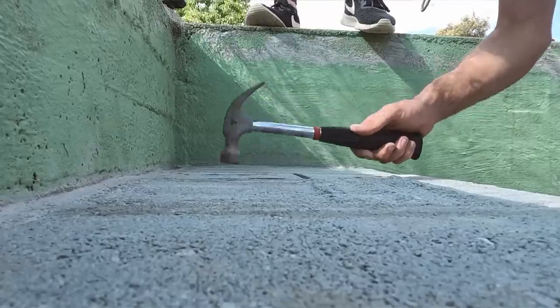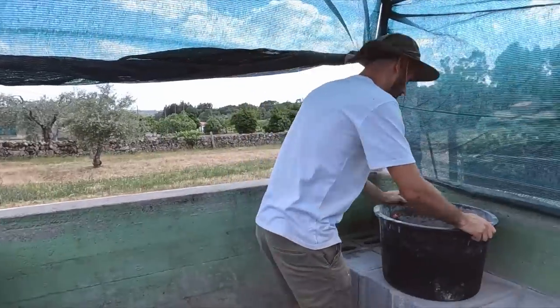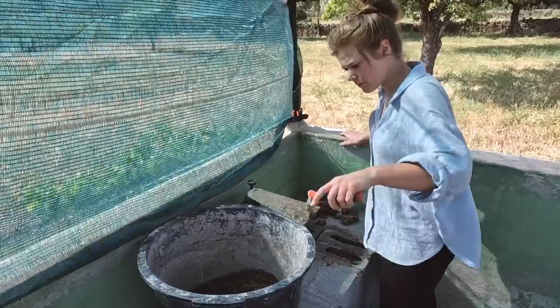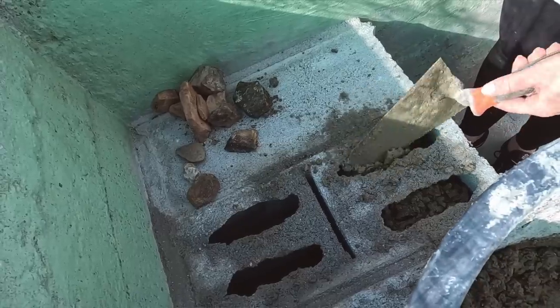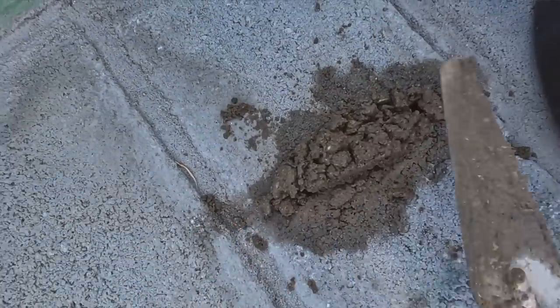It's late in the afternoon and it's cooled down a bit now - it's been a hot one today so we've been trying to stay out of it. The objective for this afternoon is to try and get the first coat of render onto this bench. But before we can do that, there are blocks on the top and some of them are really weak with holes in - we just sit on them and they start to crumble. So we're going to make a bit more of an opening in them, fill them with some concrete and some rubble, and then we'll start rendering.